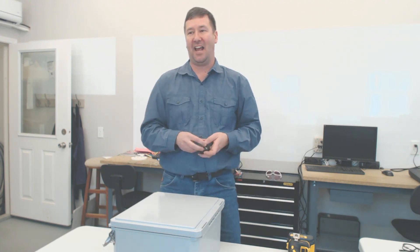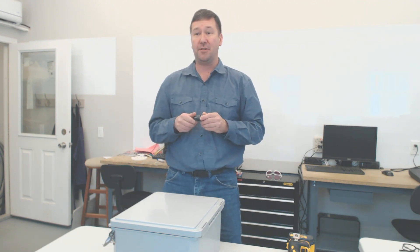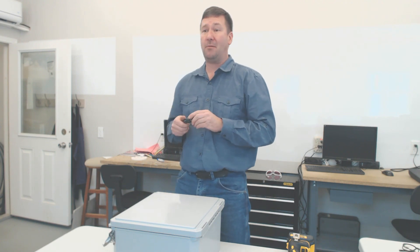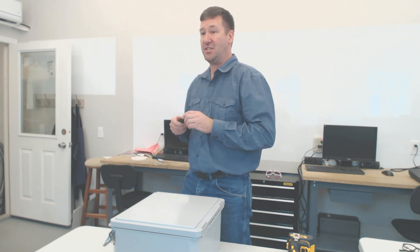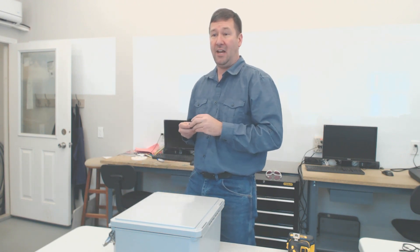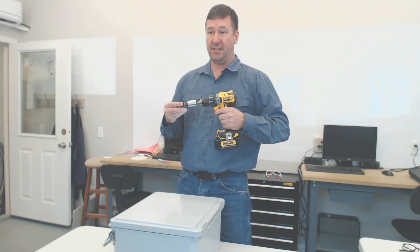The next method is the knockout. Most people are shocked to find out that I almost never use knockouts. Some weeks I drill hundreds of push button holes, but I've probably used a knockout twice in the last year. On top of that, I don't even own a hydraulic knockout set, though I do use a socket connected to a drill in place of a ratchet.